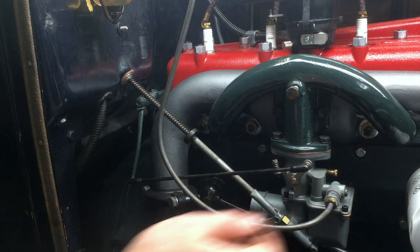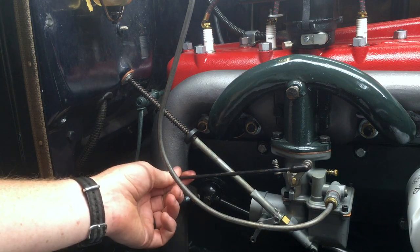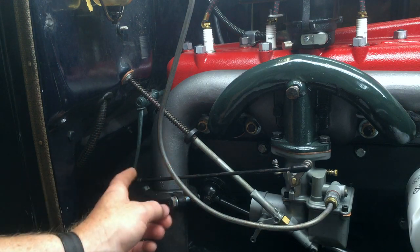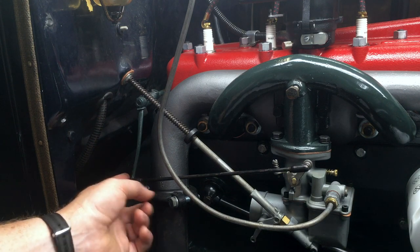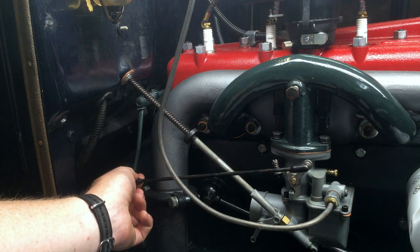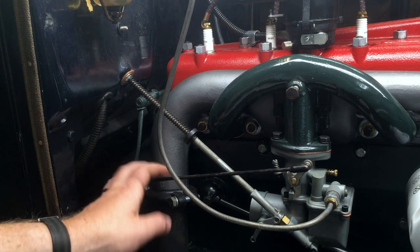Make sure that when this is connected, the throttle lever is all the way against the stop. If it's not, you can make some adjustments. You can make sure the rod is the correct length — the center-to-center dimension on this should be ten and five-eighths inches. You can also try bending the throttle arm; that's actually what I did. Mine started out not getting quite far enough, and after bending it I gained about a quarter inch. Now it goes a little too far, but that's better than not far enough. If it's way off and doesn't line up at all, you may need to repair or replace your throttle control assembly.